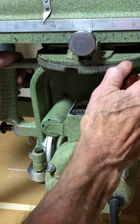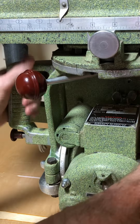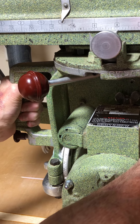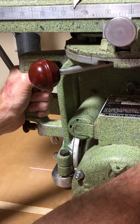My clamp is tight. Now watch the mark on the yoke and the bearing carrier. I loosen the clamp — watch the movement. You can see the yoke is spinning on the tightened king bolt and the dog screw.